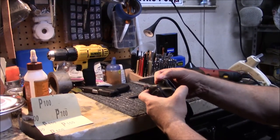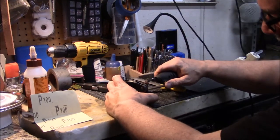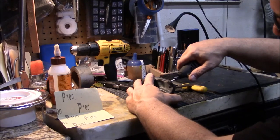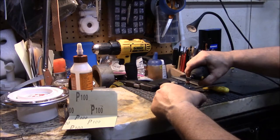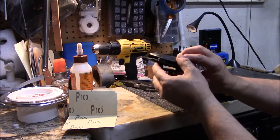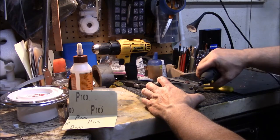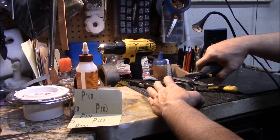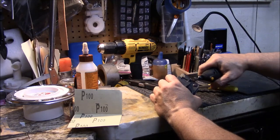That actually had a little polishing rouge on it from where I was doing something earlier. I'm going to cut the speed back just a little — it's much easier to work slower than faster without damaging anything. One thing I'll show you real quick: you want to bevel the edge. The very corner, you want to bevel that as best you can — that knocks off that sharp edge that's going to be against your skin. I'm holding it at about a 45-degree angle just slightly, to make that edge nice and beveled, and I come around to the back side the same way.